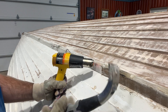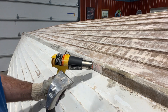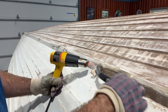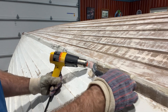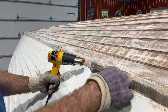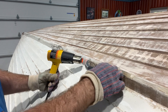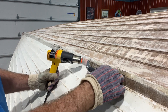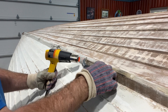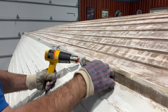See down here — and then going the opposite direction with my Ace scraper, it's a straight edge. Just look how it peels that paint. I keep the gun a little bit ahead of my work and it does the same thing on the planks or the straights. This was really hard to do before with the stripper. I just let it ride on that straight, the garboard strake, and keep that gun right there where the work is — it just peeled off like a ribbon.